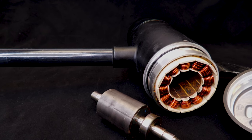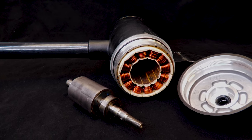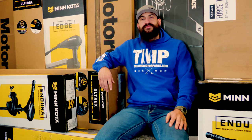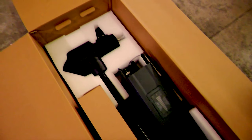With brushless motors, they use a permanent magnet for their rotor and the stator creates the electromagnetic field. They do not use brushes, which means no friction. This helps them to run quieter, faster, cooler, and more efficient than a brushed motor. The downside is they're a little bit more expensive to manufacture. There's currently only a couple of trolling motors being made with a brushless motor, but in the years coming we expect to see a lot of models going brushless.